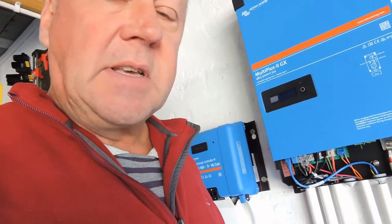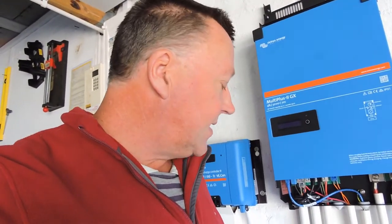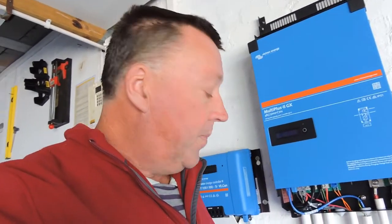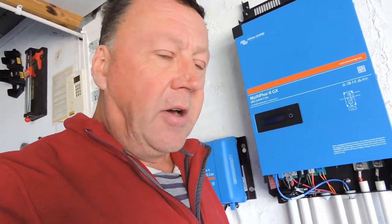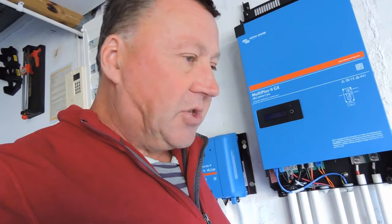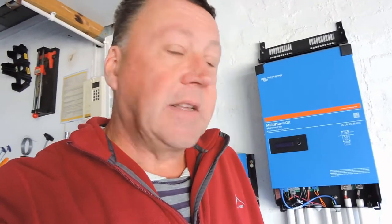The wireless is obviously a great asset in that you don't have to go and rewire half your home. So you can control loads like pool pumps as well. When it's cloudy you don't want your pool pump running, especially if there's load shedding or it's just using up your battery. So you can set up a relay rule for if state of charge is anything below 70%, then power that Sonoff device, and in turn you put another Sonoff device on your pool pump and it shuts the pool pump off on a cloudy day to conserve power.